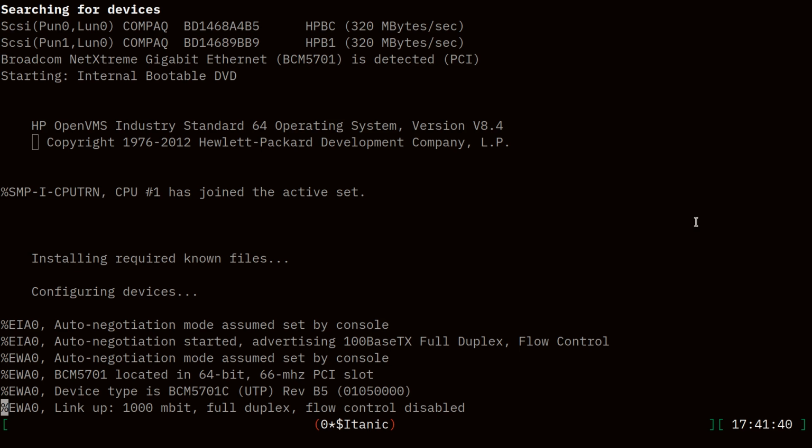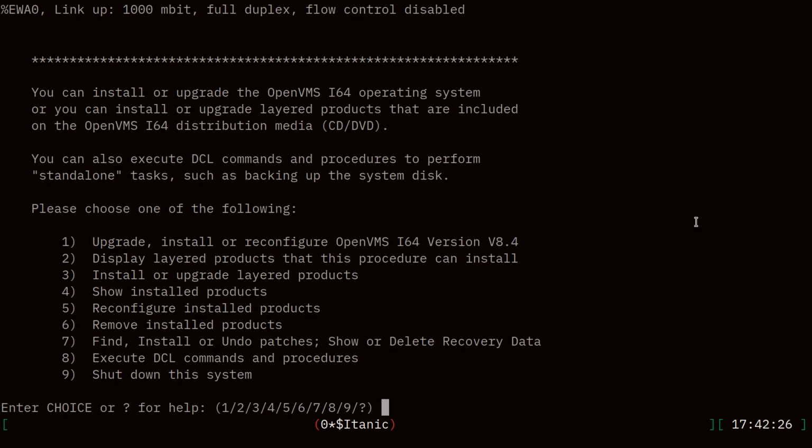as it did, but it turns out that we ended up being able to just make existing processors that use the traditional instruction model much, much faster. And it was harder than I think people anticipated to write compilers that were smart enough to fully take advantage and optimize for a very large instruction word architecture like Itanium. So we ended up not really seeing any of the theoretical performance advantages. The traditional processors just became more and more powerful, faster clock rates, as well as adding better speculative execution and branch prediction and all of those kinds of things that really allow them to have the same sort of performance benefits that explicitly built simultaneous execution of operations could do.